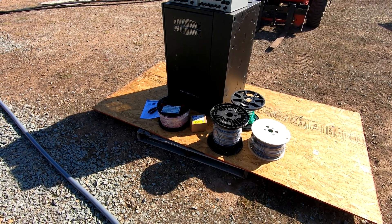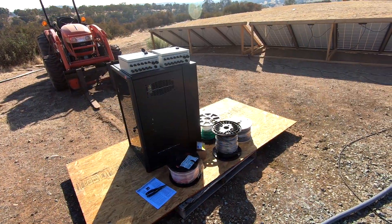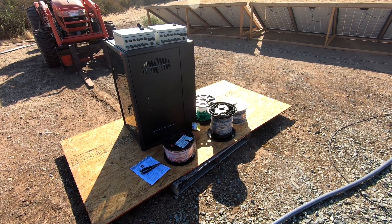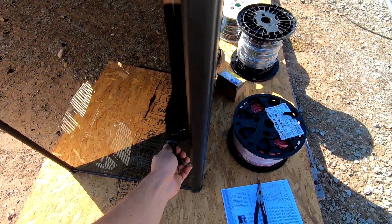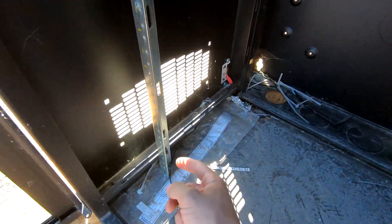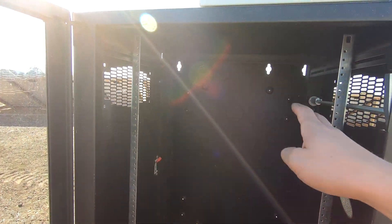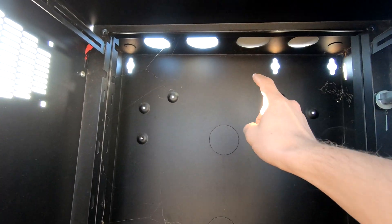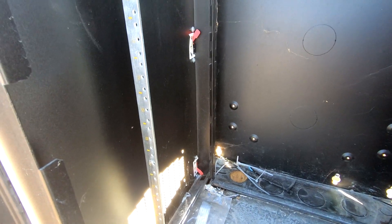What I'm going to do today is I have a pallet on the ground because this is all going to be portable, because we haven't quite figured out exactly where this stuff is going to go once we get our shop built. I'm going to mount the piece of plywood to the pallet, screw it down, then cut the piece of plywood to be shorter, bring the remainder into this server rack. The server rack is cool because it has a key, and I can take these rails down here — they're just mounted with bolts top and bottom — and slide them back to create more room for the piece of plywood. I'll just screw it in with these screws, mount my combiner boxes, and bring the wires in from the back, looping them around so they have a nice drip loop.